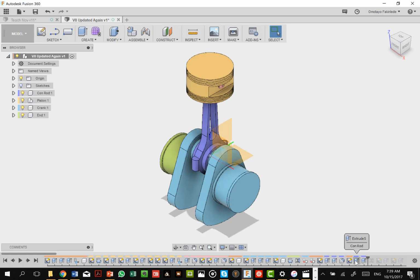We now take a look at what we did to the con rod here. After filleting, we drill a 10 circle there, and then we use a 15 circle to create some space around the connecting rod for the head of the screw. All these things are mirrored. We do mirroring to the other end, and then mirror those faces again to the other side of the connecting rod. So having done that, we are then in a position to begin to now create a cutting plane.